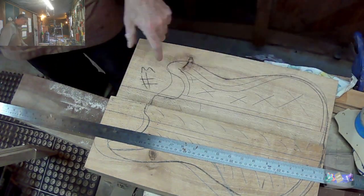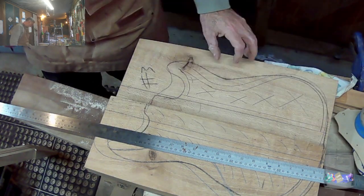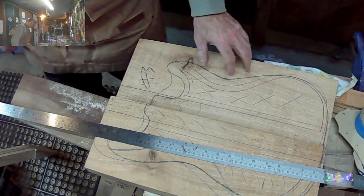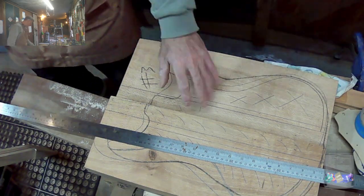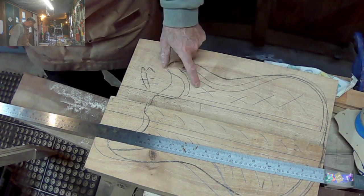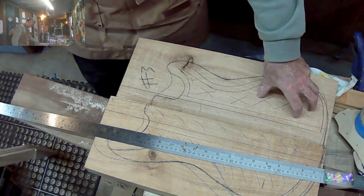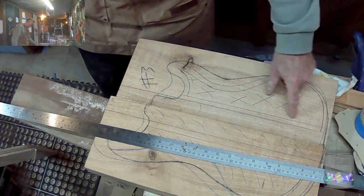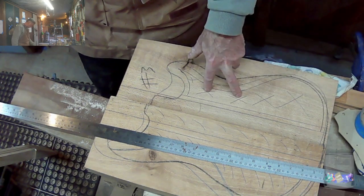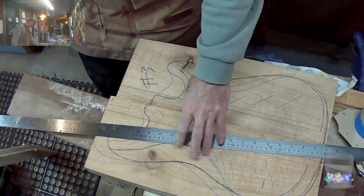Chamber though, that's going to take a lot of the weight out, but still leave a substantial piece of weight with that neck through and some of this thick area in here. And there's enough thickness there at 45 to make that, bingo, Bob's your uncle. Some holes in here. Deep on this side. On this side we can go right through. I won't go right through until I mark out where the controllers are going to go. But we need to go at least 20 millimeters deep. This side we're definitely going to go, or 25, an inch deep at least at the front.